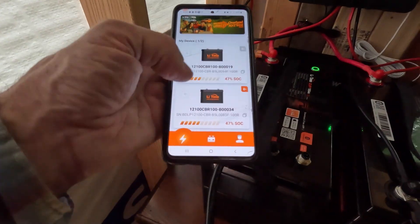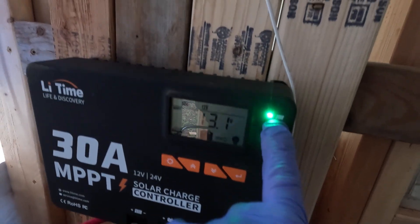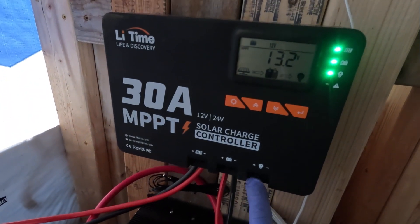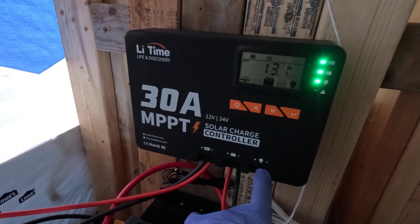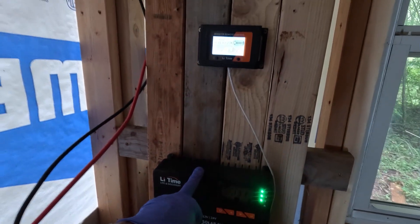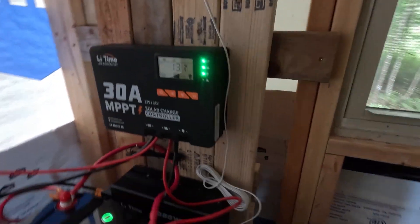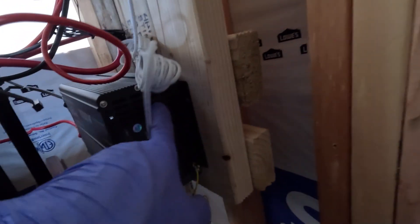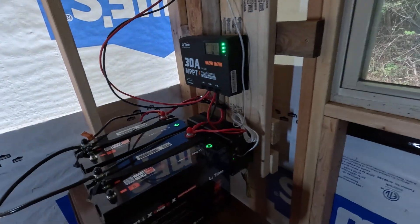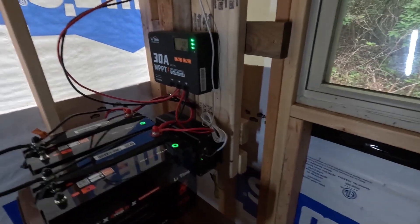So that's what I wanted to show you guys. Green light on the batteries, green light on the solar panels — solid means it's working. I could hook up a 12-volt light here if I wanted to. Basically what this system is doing is converting DC coming from the solar panels into AC through the solar inverter, so you can plug in your appliances. It has three outlets already built into the inverter — you can plug in a refrigerator, a stove, anything of that sort. I'm planning on putting in a power strip so I can expand and run power wherever I need it.